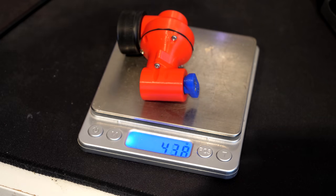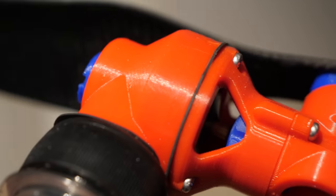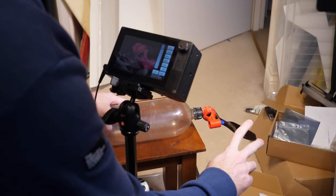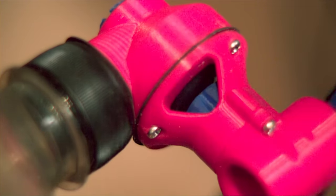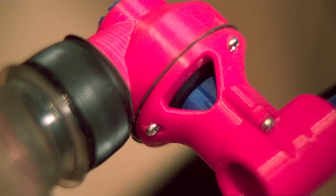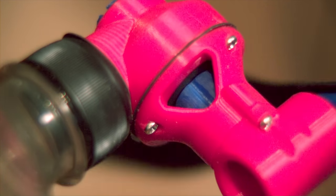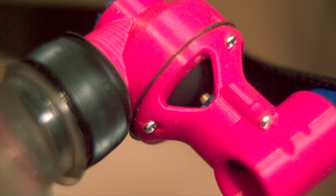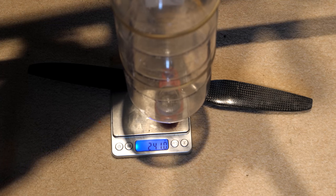This results in a weight saving of 17% over the previous version 4 engine. I also realized if I drastically increase the size of the exhaust ports, I should be able to aim my high speed camera at the diaphragm and you can see the piston move up to open the inlet valve, then the diaphragm expanding and breaking off from the piston, exhausting the pressurized air. Once mounted on the plane, the total weight of the aircraft is 243 grams, which is about an 18% weight reduction.